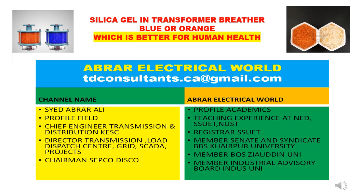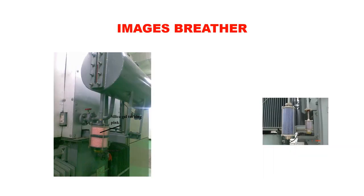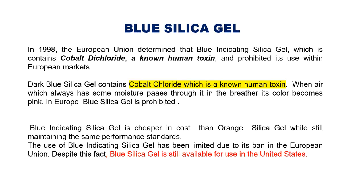Now we look at the advantages and disadvantages of these two kinds of silica gel. I have shown here a breather — the breather is always installed on the transformer connected to the conservator, and it provides the path for atmospheric air to go in and out of the transformer oil, so that the space between the oil and the conservator is filled with air.